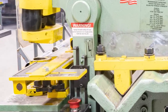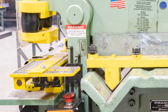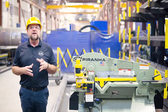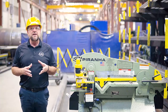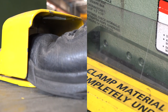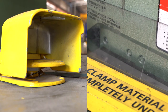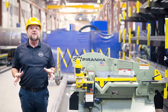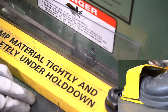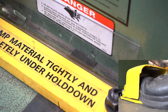There are two levers or switches located to the left of the angle shearing section — these are called the limit switches. When set correctly, these limit switches allow you to save time on each of your cuts by giving you control over the height and depth of each stroke. These limit switches are for use with the foot pedal and will allow you to clear the material for the cut effortlessly and successfully cut all the way through the material with the pressing and release of the pedal.